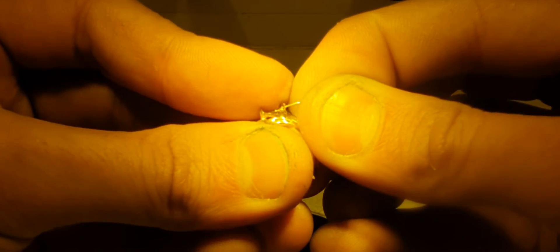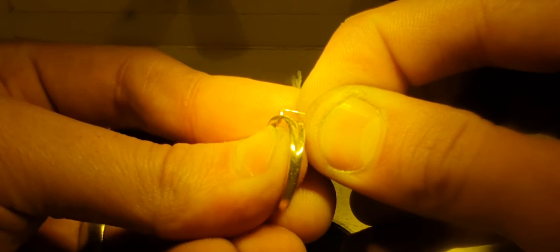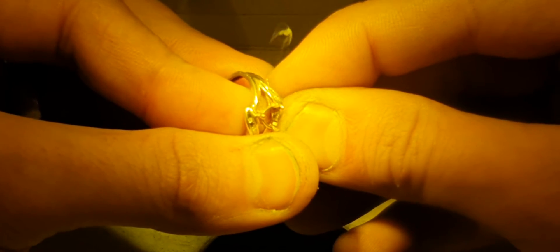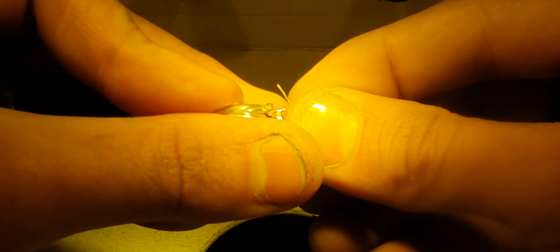This is just a cheaper style ring — stones came out because it's burnt out and worn out. Rather than replacing the whole claw, I'm just sort of building up metal on top, shooting a little bit on and then hitting it from other angles to make sure there's no bubbles, no air, and no little bits underneath on the inside of the claw that are going to create little cavities later.